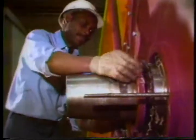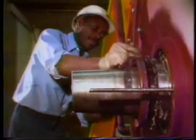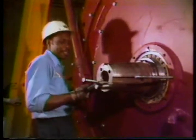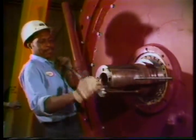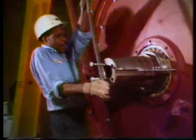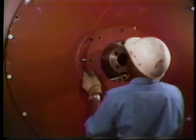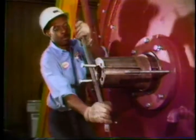Remove the shaft nut from the shaft and nut spacers from the two starter bolts in the inner bearing seal. Now install the other magnet, outer ring plate, and center plate to the other side using the same method. After both magnets and center plates have been attached, check to make sure the rotor turns freely. Now install the bearing cap — tighten two screws opposite each other first, then check to be sure the rotor still turns freely.